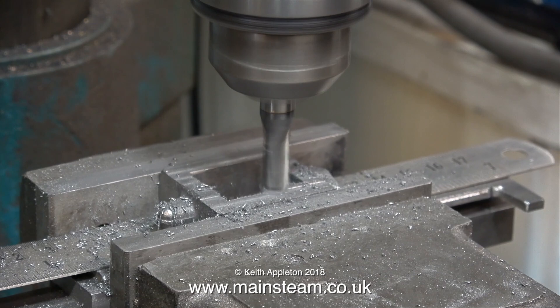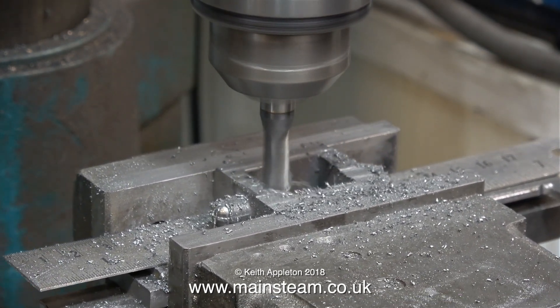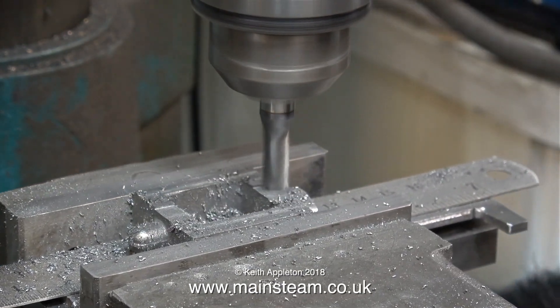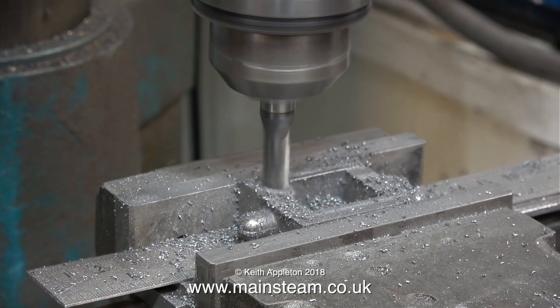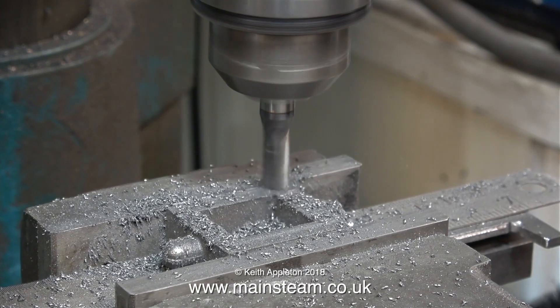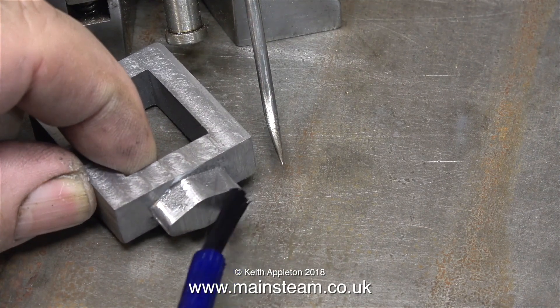This is a slightly deeper cut, so I'm observing the normal protocol, which is always to cut in the direction that the cutter is rotating so that the work is against the direction of rotation. I'm not taking very deep cuts anyway — I just went back the wrong way as you've just seen, but normally you need to go in the direction that the cutter is cutting.